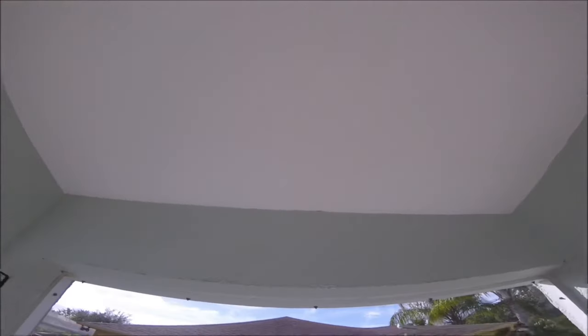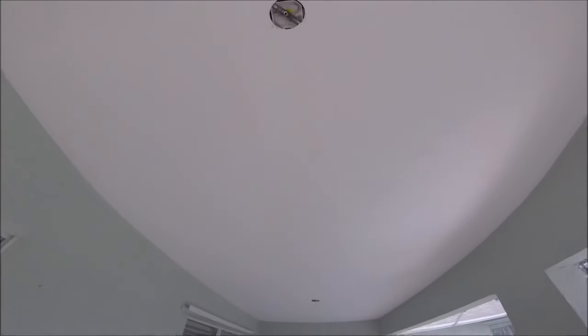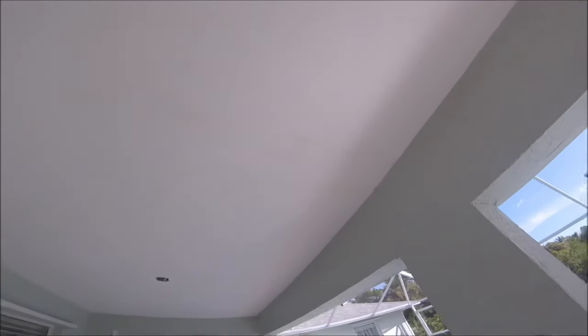The moisture is coming back down on the back side of the drywall. Because when you finish joints, there's nothing sealing the back of the joints. So in my opinion, in combination with the heat and humidity here in Florida, the attic getting so hot, and the moisture — that's what made the tape joints fail. And I think the yellow spots are actually moisture coming in from the evaporation of the pool water. Let me know in the comments if that changed your mind about what you think is going on with this ceiling.